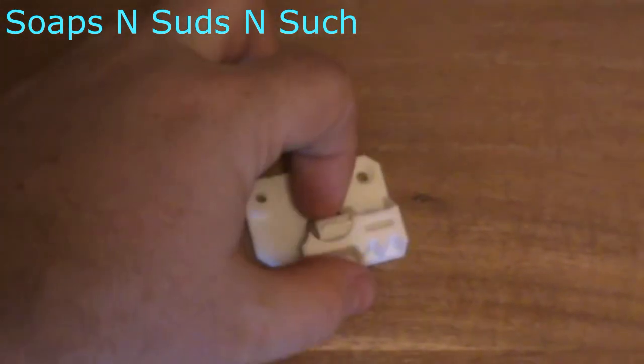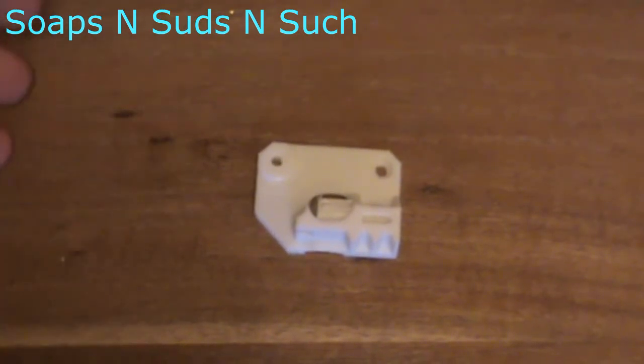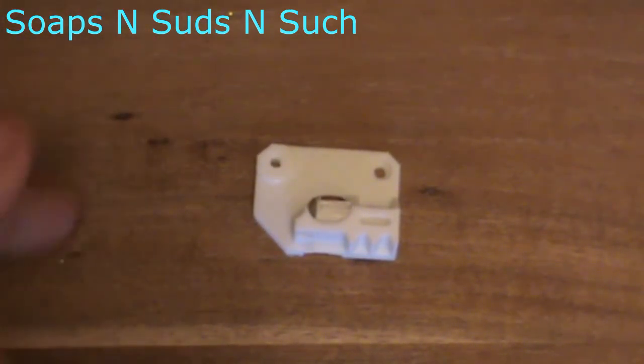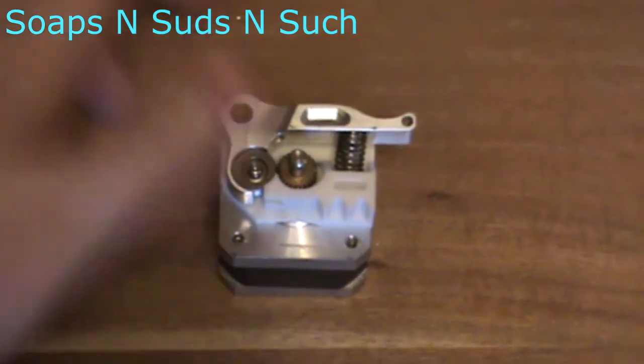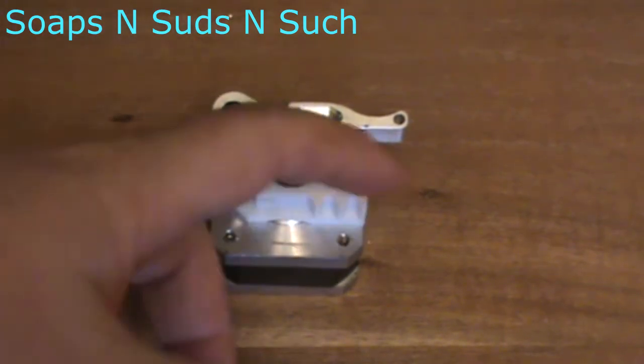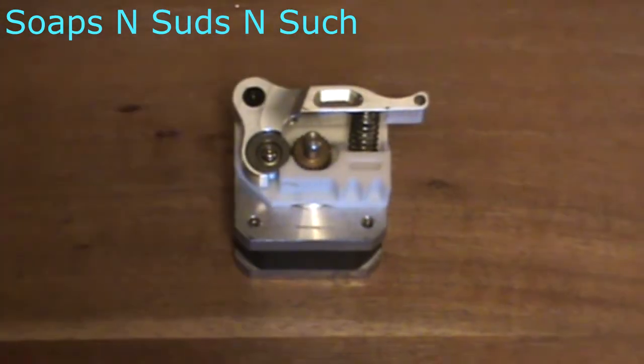It's just the benefit of adding in a little bit extra for your needs or wants, because if that gear gets clogged you're going to have to either find a brush or something that you can clean it with while you rotate the gear, or you're going to take off the extruder plate and clean it that way. Hopefully this will help reduce your need to clean the extruder gear. Especially if you're printing flexible filaments — having anything in those gear teeth will hinder your abilities to print it, which is why the Flexion has a brush. But if you just want to print a part for your stock direct drive, hopefully this will do the trick.